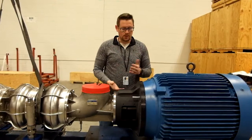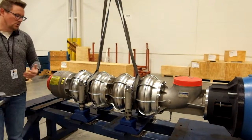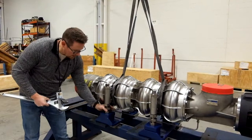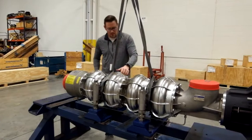Now that this is well within our criteria of acceptance, I'm going to lock the foot into place so we don't get any change in elevation when we go to the next step. The first thing is the bottom nut — make sure it's snug to the bottom of the support bracket. Then run the top nut down until it's snug and tighten it with the wrench. Then run the jam nut up to the bottom and snug that to make sure nothing works loose during operation.